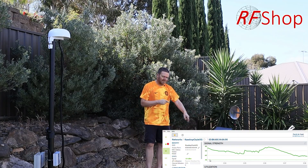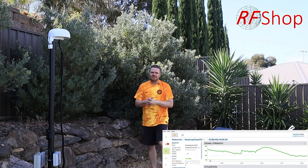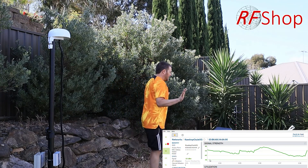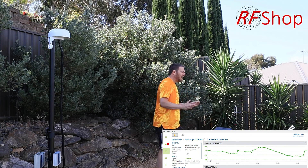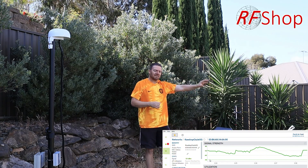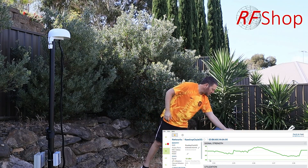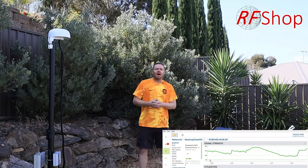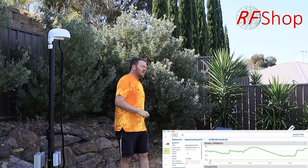As a cross-check, I'm turning the antenna back to where it was before — that's all I'm doing, not touching any buttons or settings on the computer. The difference is immediate: it jumps right up. Right now it reads minus 50, and with some optimization to find the exact right direction — accounting for the house and reflections — it can go higher. I just turned it slightly and it's going up significantly. At the beach, it'll just be me and the source, which will make testing much cleaner.